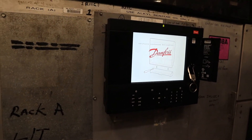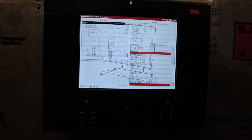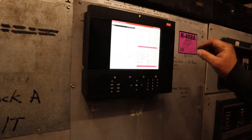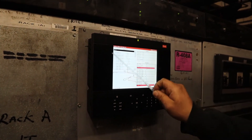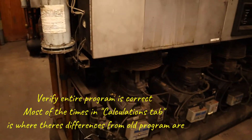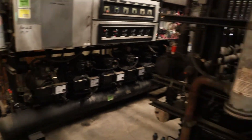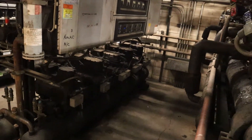And this is going to reset, and we're good. So that's how easy it is to do those 880 controllers with the old programs. Doing it from scratch is tricky, but loading it from an old one to a new one — it's just that easy with this trick. The problem with this trick is sometimes the calculation doesn't take everything. So the 0 to 10 becomes 0 to 5. You've got to go through the program and make sure it took everything. You can't just slap in a program and leave — then you're going to get yourself into trouble.